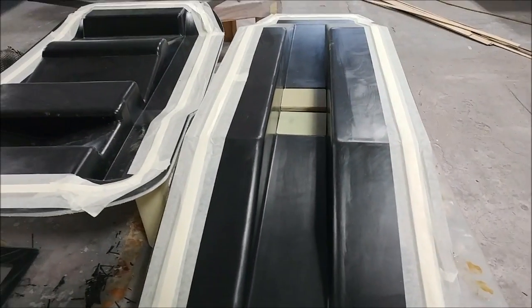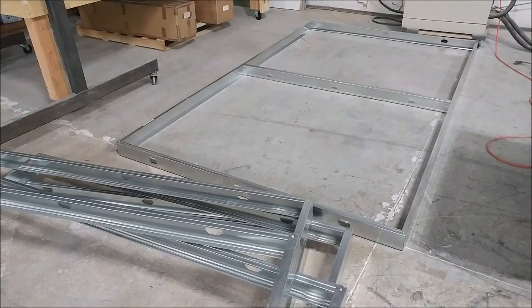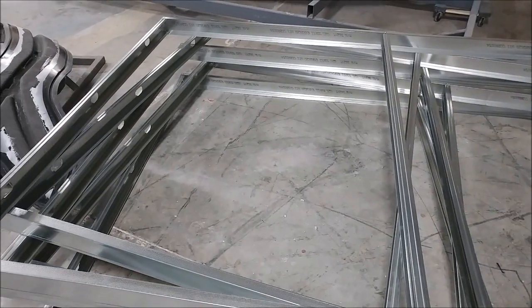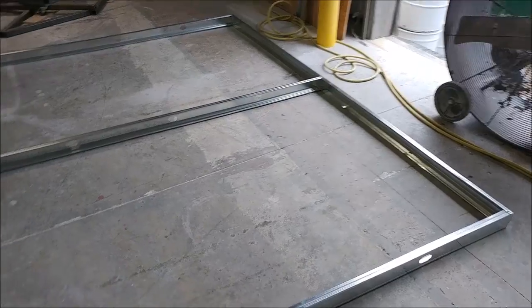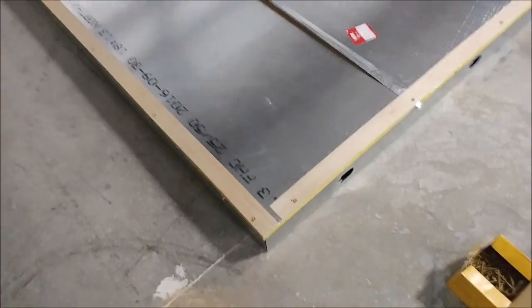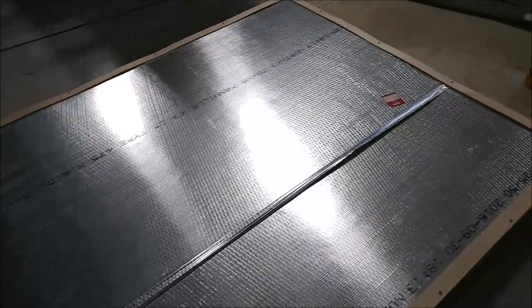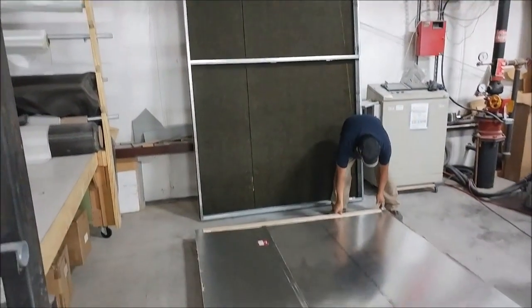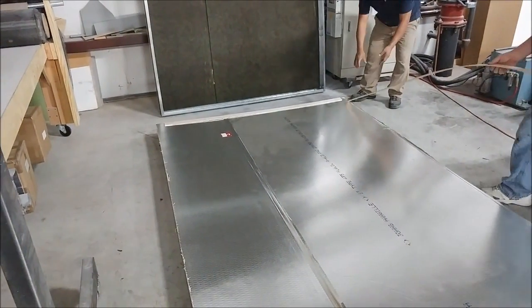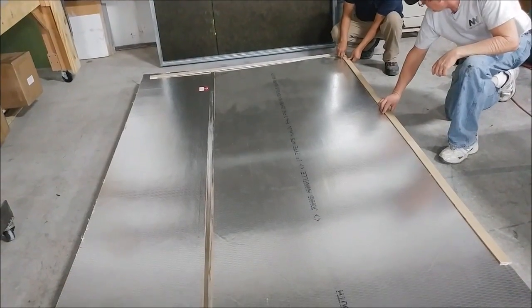Back to our oven — I got all the walls all screwed together so they're basically laid out, waiting to have the insulation board put on them. In the meantime we needed to rip some flat plywood to use it as a board to hold the insulation in place. The oven is going to be about 20 feet long, about eight feet wide, and about six feet high. There you can see one wall with the plywood screwed around the edges so the screws don't pull through the insulation. Roberto and Chris came in this afternoon so we handed the rest of this project to them — they'll probably have most of it done this evening. There are also some circulation fans on order that will be coming in soon, so it won't be long before we can bake that main spar.